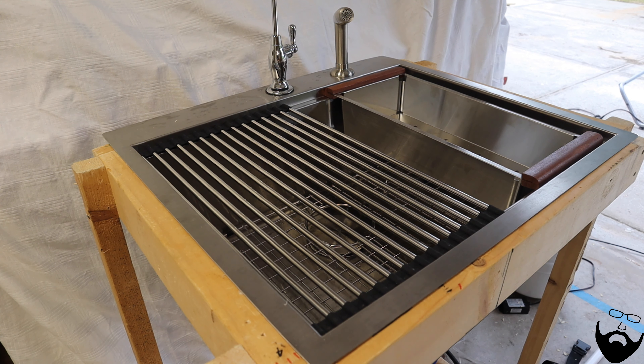I modified this a little bit — it was extremely easy to do. All I did was add some on/off valves. The way it's set up right now, this valve is closed and this valve is open, which means the water is going through the reverse osmosis system, purifying the water and filling this tank. If I close this switch and open this one, now the water is going only through the filters and into this tank. It will continue to vibrate like that until this reaches 55 pounds of pressure. If I flip them both off, now no water is going to flow at all. But while I'm here at home with an unlimited water supply, I'll run it through the reverse osmosis system to be sure I have clean, pure water.